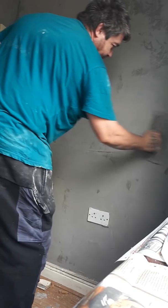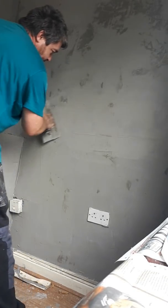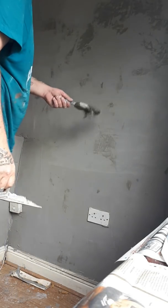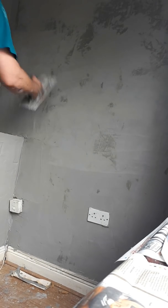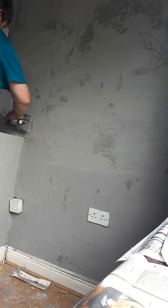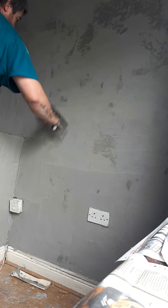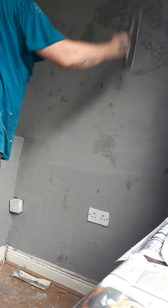And you can then go back and put a little bit of fat on the flat like you were doing the first time. Again, this is not what a plasterer will do. For someone who hasn't plastered before, this is exactly what you should do. And you'll be filling in more little dips and bumps. Again, coming away from your edges. If you see any kind of little grooves or dips, put stuff across them, pull them in.